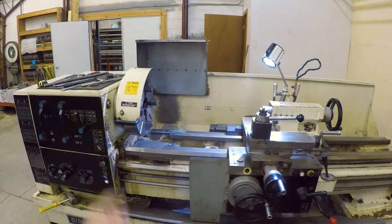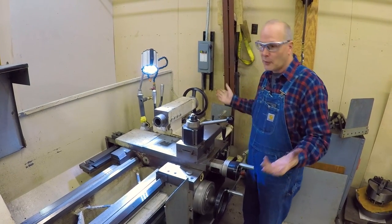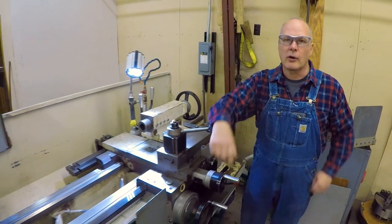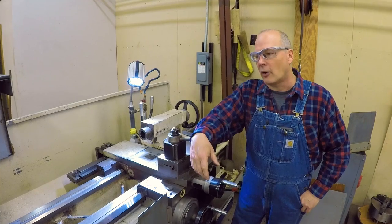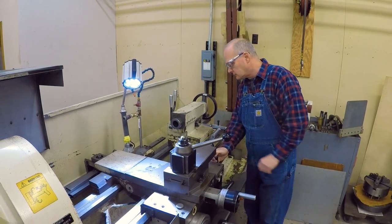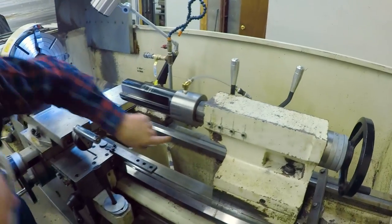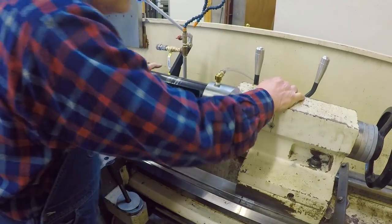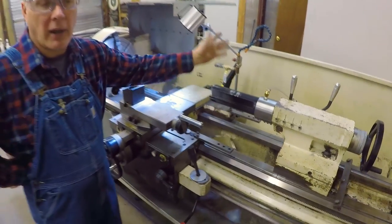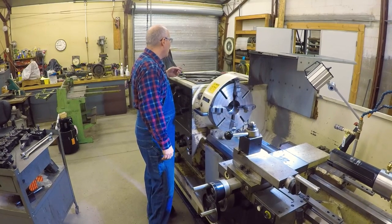I tighten these up a little bit so I don't have the thing vibrating. It's a real fine balancing act — you just go, 'yeah, that seems good enough,' and if it vibrates you tighten it a little bit more, and away you go. If you're watching this channel and you've never seen how a manual lathe works: you've got a motor that turns the chuck, and in the gearbox you've got gearing that comes out onto these shafts. You can control this manually, but you can also set dials that control the feed rate of the cross slide relative to the rotation speed of the chuck. Also, I'll put a groove in the face of the part first — start the drill with a face grooving tool to give it a start point.